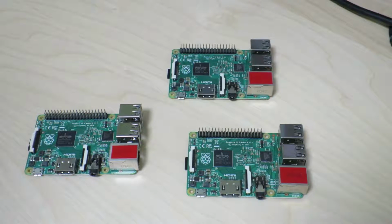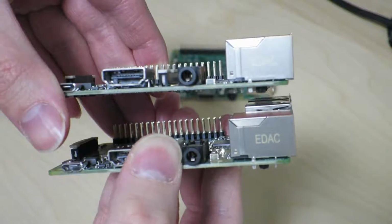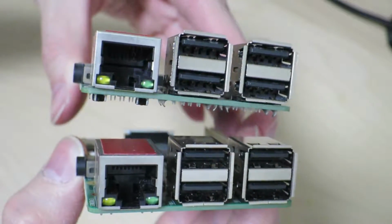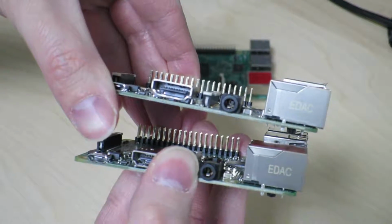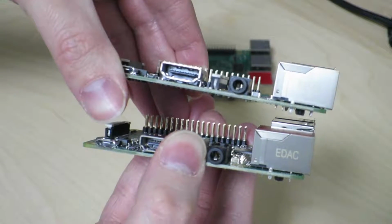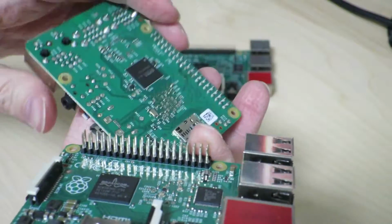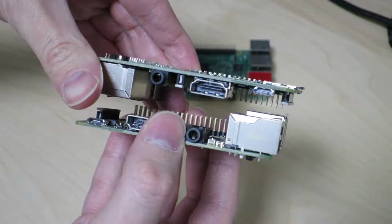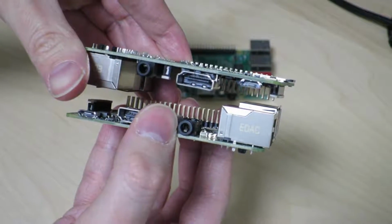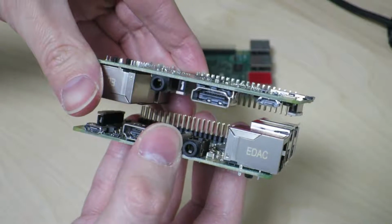The trick to figuring out how we can get a denser Raspberry Pi tower is to notice one thing. Previously, we were stacking the Raspberry Pis in an orientation like this. You'll notice in this situation that the USB ports and the Ethernet ports are going to bump into each other because those are the parts that have the highest height. Now, if we try to make those ports not be right next to each other, for example, by putting it in this kind of orientation, you'll notice that we probably could get a higher density arrangement of Raspberry Pis if we go like this. So let's go ahead and try to get some standoffs and connect the Raspberry Pis together in this configuration.